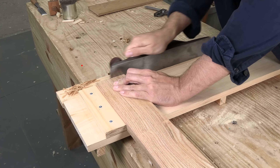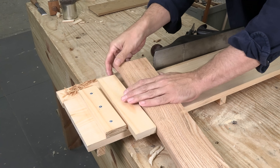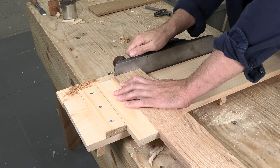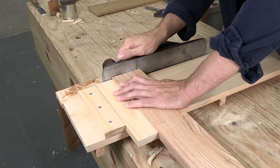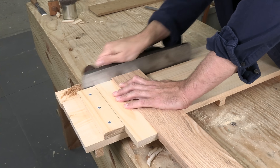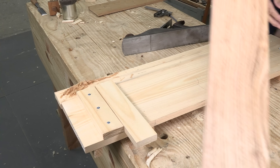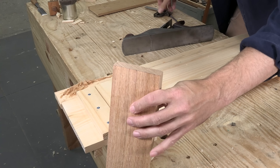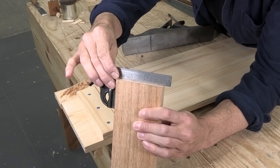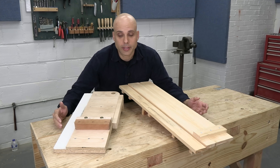I work a little bit in the middle until the wood is mostly square, and I just need a few final strokes to clean it up. The wood isn't up against the fence, so I could blow out the back of that grain. To keep that from happening, I put a piece of scrap stock between my work and the fence — that scrap supports the end fibers while I take the last few full-length strokes. You might be thinking that this can't be as good as a modern shooting board, but look at the results: the end is perfect.